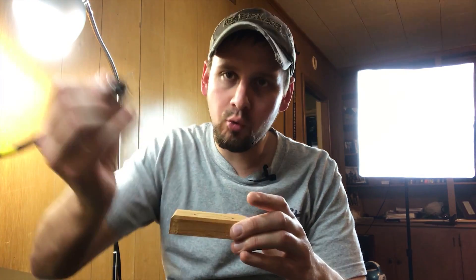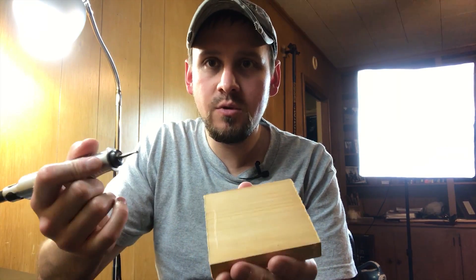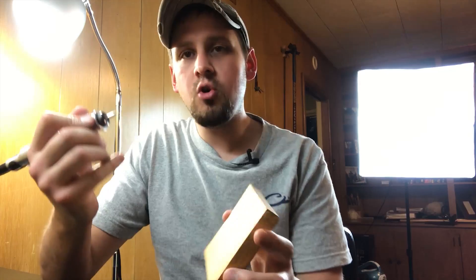When you first start, this rotary burr is going to be turning clockwise. You have to watch out — if you don't keep a steady grip on this the burr will run from you. See that? It just falls flat and runs away. So you want to keep a steady hand while you do this.